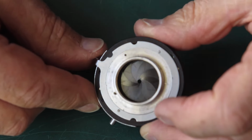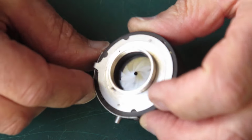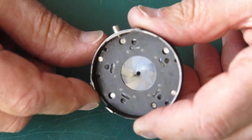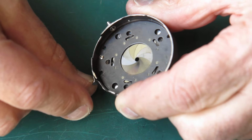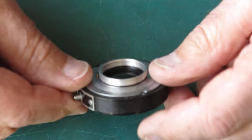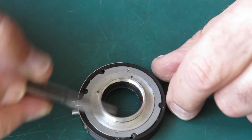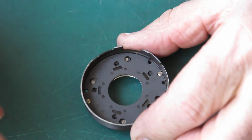And in this case, they're a little bit stiff. The action's a bit stiff. Now that can be a couple of things. Typically it's oil on the blades, sticking them together and making it difficult to shift the lever across. But it can also be the lever itself. There's two screws coming through from the inside there which connect this up with the ring that opens and closes